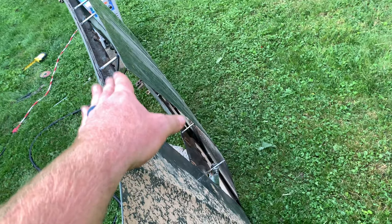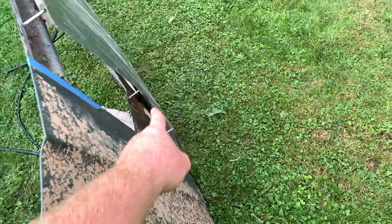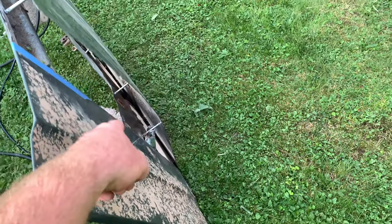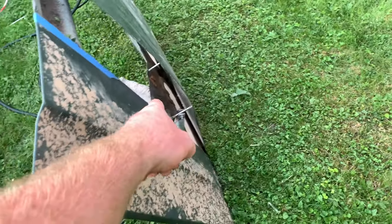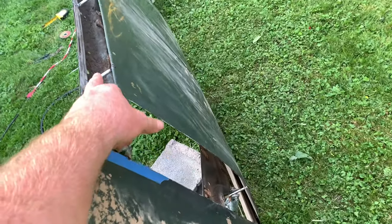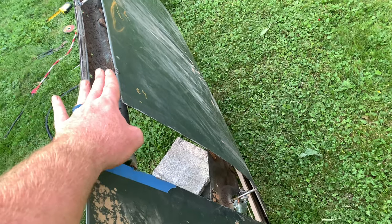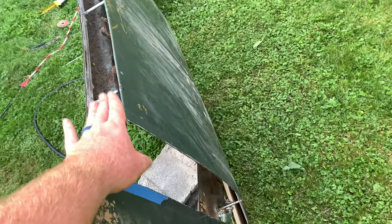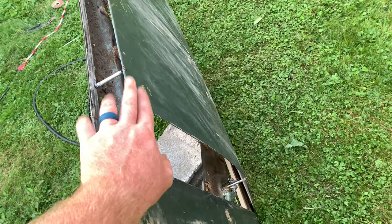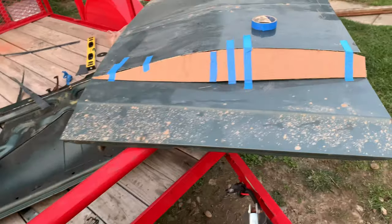As you can see I welded in little rods across the front and the back. I welded these a little bit close because I'm going to be putting screen there — you won't see it when we're done because we've got to put metal here; this is just for support all the way across. I tacked these in here with a little bit of overhang for the screen mesh. This stuff is really thin so you have to be careful not to burn through your hood.